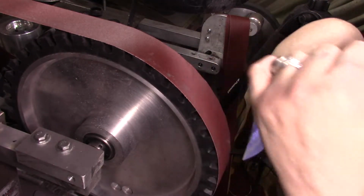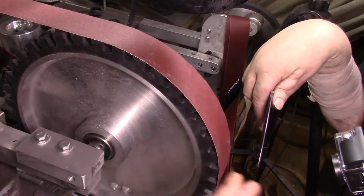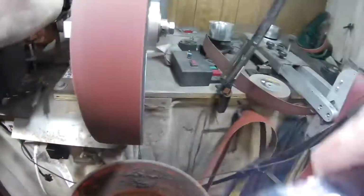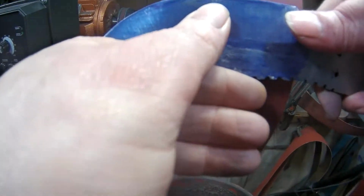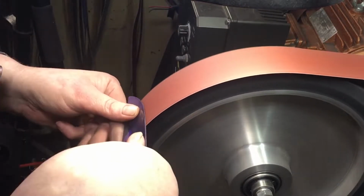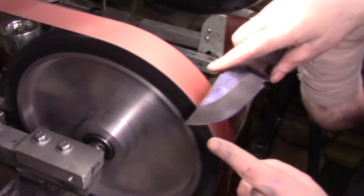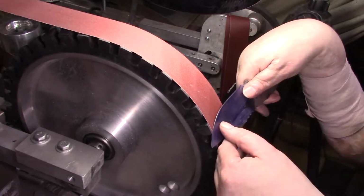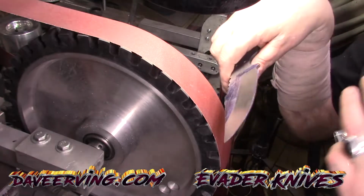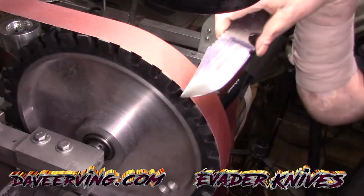So, yeah, on that first knife, I should have gone back and, once I saw that I had to cut more in, gone back down to an 80 or at least a 120. Okay, here we go. I almost forgot this hollow. I had to pull out. I started pulling out, and I was like, oops. And I was like, oh, wait a minute. So yeah, don't forget which knife, if you're going down or out or what you're doing. You want your ground lines to all be even.